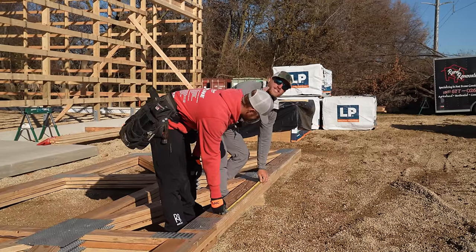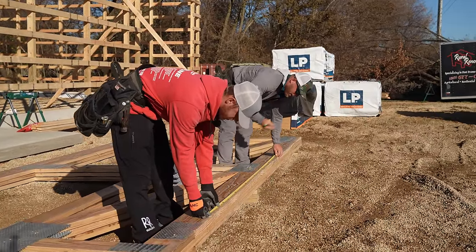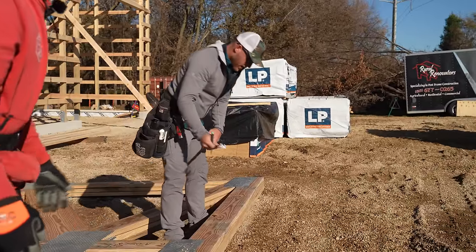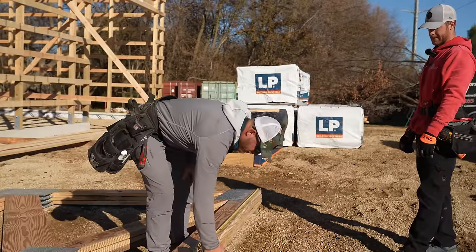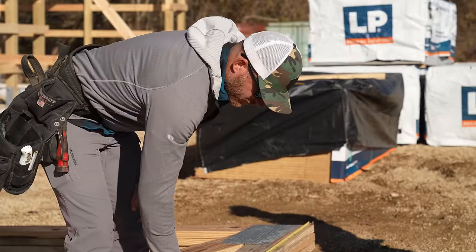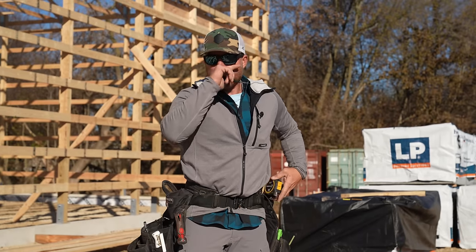I always try to make sure that my sheathing is as efficient as possible. So I'm doing as little waste as possible while also trying to be sensible and efficient in the install itself. That right there is our last truss. There'll be an odd bay on the shed dormer. And then when we're coming back this way, we need to do the same thing that we did on that side. Yep, so here's my truss on the side of my post, which will create the wall of my, we'll have to add a laminate to this guy here because I'm not gonna put another truss right next to it. And then we'll be 2 foot center out into our overhang, which should be a 2 foot overhang. Okay, let's get this marked up and let's fly this sucker.